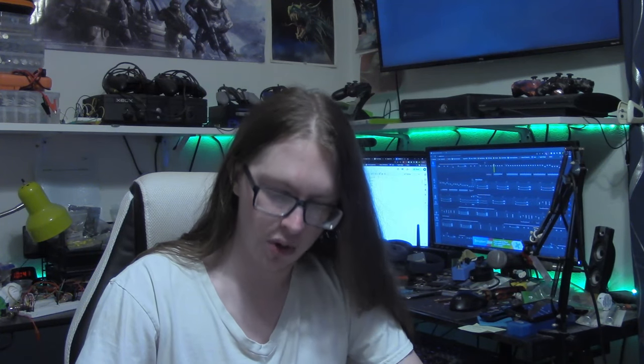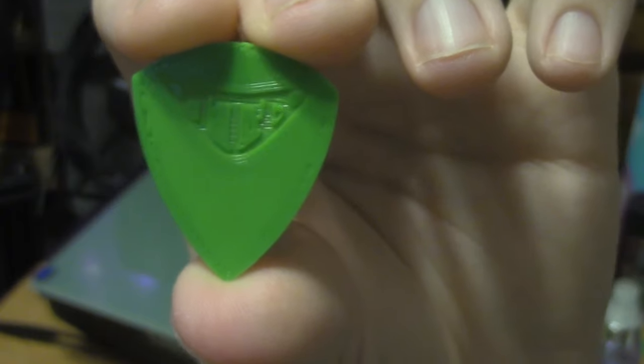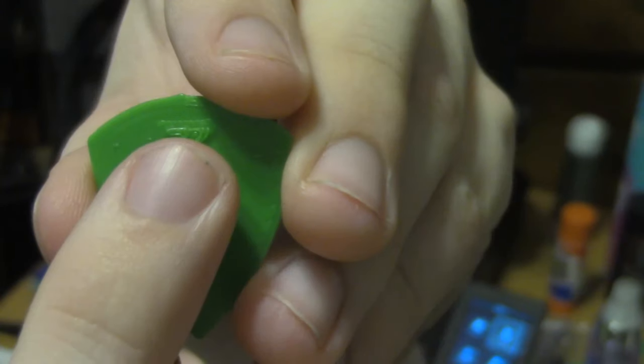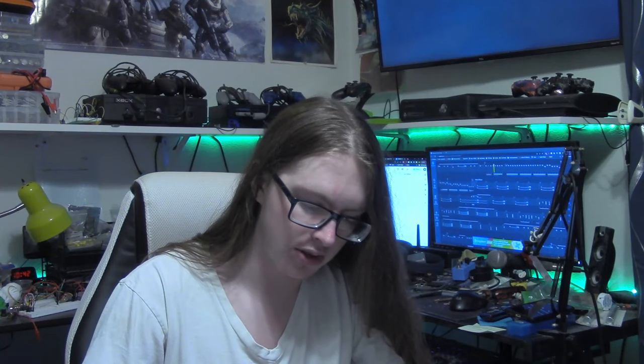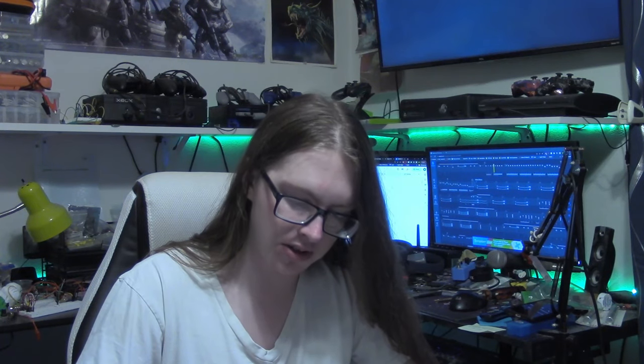I had done a few prints before the clip was recorded. We got great top layers and good first layers as well, though we were still having issues with the logo and some minor gaps where the skin meets the walls. Because prints in the middle of the bed were going so well, I started trying to print batch files — multiple picks at the same time in one print. However, this revealed new problems: when printing more than one pick, the number on the face started to get a little over-extruded, and there was a strange line across the top layer. Those issues could likely be fixed with retraction adjustments. Also, Creality Print doesn't account for the Ender 3 V3's pre-extrusion line, so if you put something that conflicts with that line, the printer will simply try and print over it.